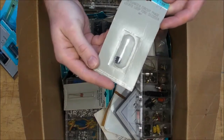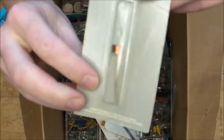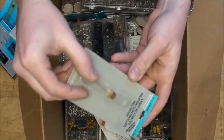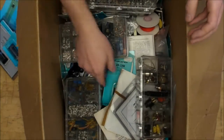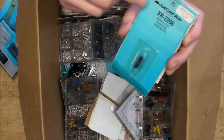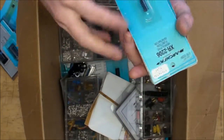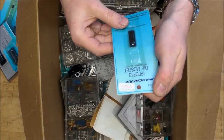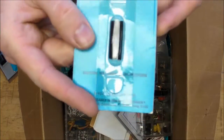Here's another integrated circuit - a phase lock loop tone decoder, part number 567. And here's a light-activated SCR - you can see the window on top of the transistor package. There's no part number on the side of the can, so I really have no idea of the exact specs. I was just on the EEV blog forum complaining about the XR2206 and XR2212 having recently gone obsolete, so these might come in handy. And here's an IRFDZ13 MOSFET in a single four-pin DIP package.